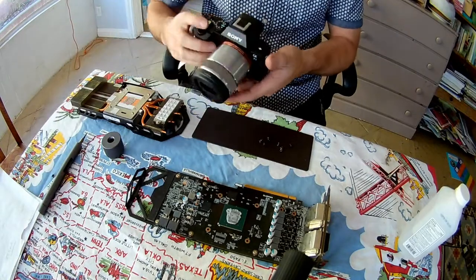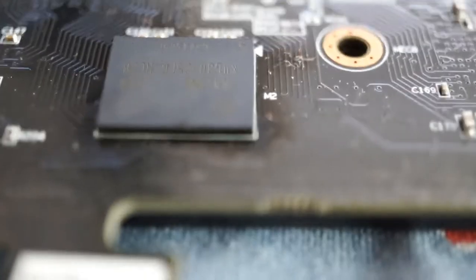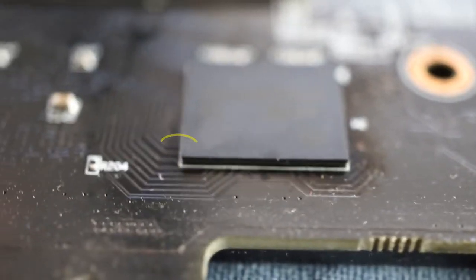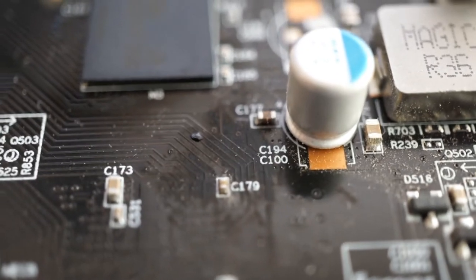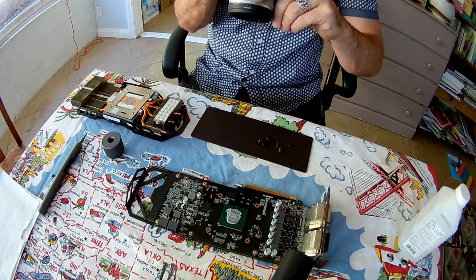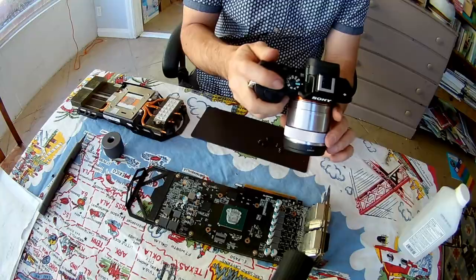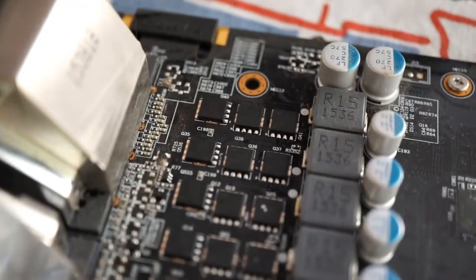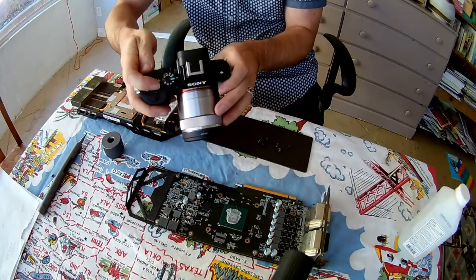Let's take a closer look at that. The thermal damage looks like a slight discoloring — I don't know if you can see it very well on the video, but you should be able to pick it out. It looks like it burned the board a bit around the corners of the device. That one's pretty bad. I don't know if that denatured the epoxy — I think it's an epoxy glass or something. If the traces died, then it should be possible to repair this board. I think about selling it on eBay; it doesn't work at all, but that doesn't mean nobody could fix it. It seems like probably just a component or two are bad and the rest works fine, but no telling which ones those are — at least I can't tell.